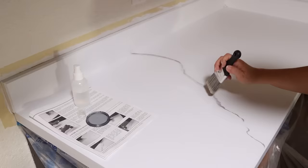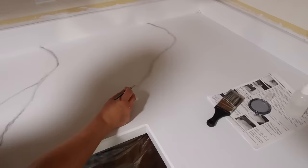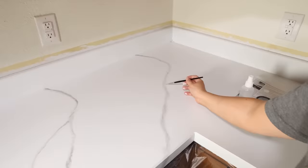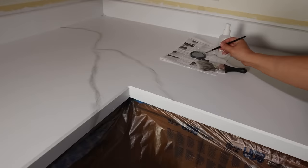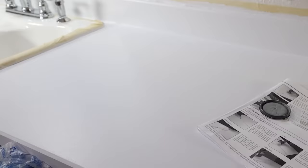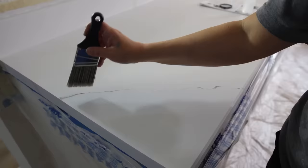When you're starting your veins, just do the main ones on your countertop. Work in small sections because you don't want that gray paint to dry before you can get to it. Once you have your main vein on, you can extend them on the front of your countertops as well as the backsplash. Make sure you're referencing the map you created and put all of your major veins on. If some veins look too dark, you can mute them by adding additional water and dabbing more with your brush.